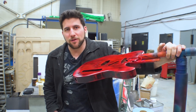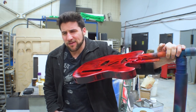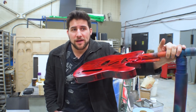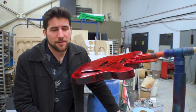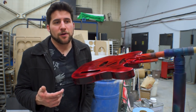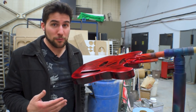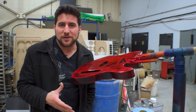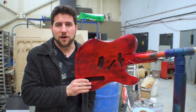Let it dry fully. It's going to smell horrible for basically that entire time — that's another downside. And it's not as durable as a polyurethane or a hardened enamel, but that has its benefits as well. Lacquer gives you a different feel and it ages. Nitrocellulose lacquer tends to yellow over time — you can get relic looks from it. You can cause cracking and what's called checking generally by getting it really cold shortly after you paint it. That's stuff you can do with nitro that you can't do with a polyurethane, which is the most common other product on guitars.